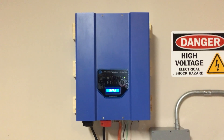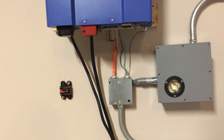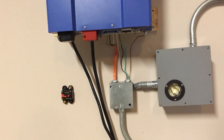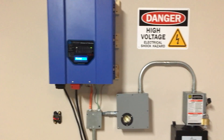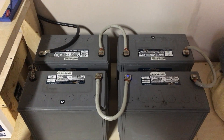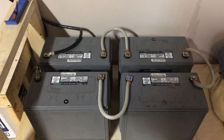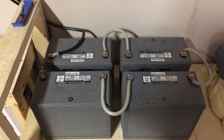I haven't tested it with any computers yet, but it seems to be doing the trick. The output from this inverter goes back through this box on 10-gauge wire, which is then fed to the wall back to the transfer panel. This is a 48-volt inverter.